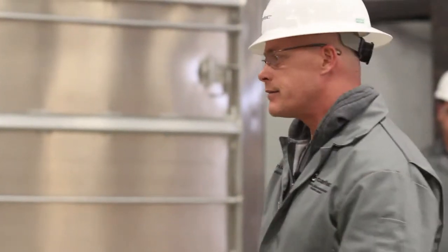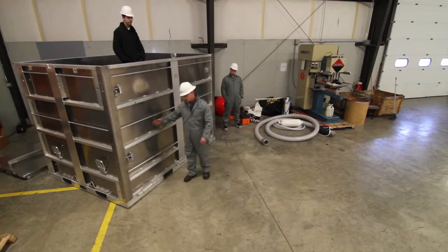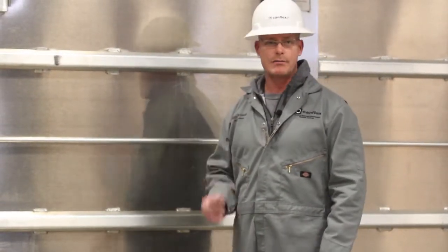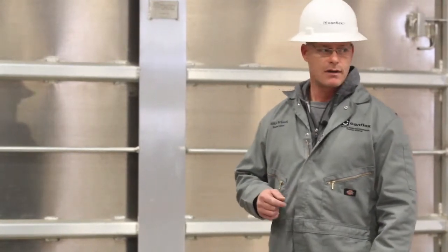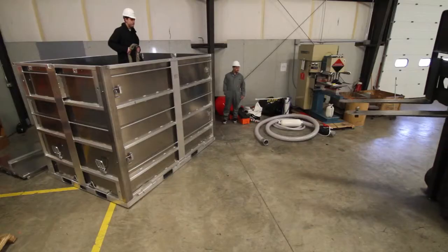So now to begin removing the door, we need to use our forklift and raise the bag a little bit. Reason being, the bag is pushing up against this door. So in order for a couple of personnel to remove the door, we're gonna lighten the load off the inside of the crate by raising the bag. My colleague's in the box right now. He's gonna tie a sling around the main pick point of the bag. A 1.5-inch shackle. We'll attach that to the fork and we'll begin to raise the bag up.